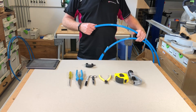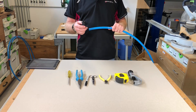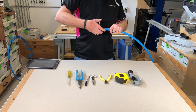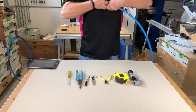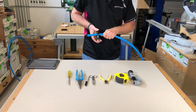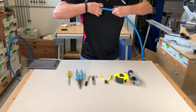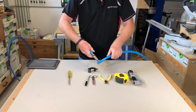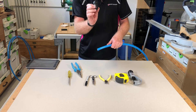It's also important to make a test cut on the end to make sure that you don't go too deep. This screwdriver is here so that we can adjust the depth of cut if we need to. I'll just make a test cut on the last hundred millimetres or so of the cable just to check the depth. I apply the tool, compress it onto the cable and then slide it along. Then we do it on the underside as well — compress the tool, slide it on, and then use the pliers to compress where we've made the cut. I can see through here that I've gone through to the cable core, but because there are no bits of fluff on the blade I can see that I haven't gone too deep.